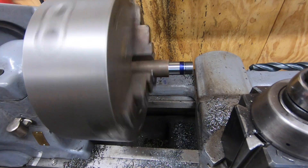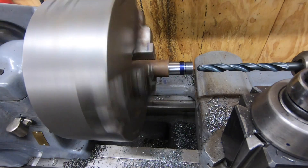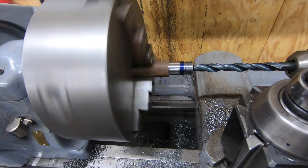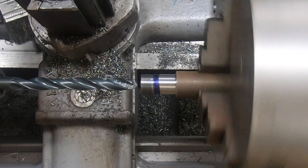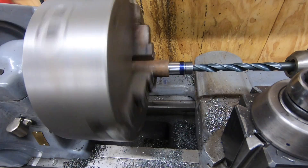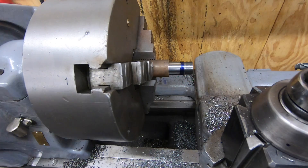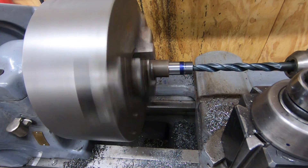I'm going to speed the lathe back up to normal operating speed. I have a 31/64th drill in the tailstock. I plan on using a half-inch chrome steel ball as the swivel joint, and I want to give that ball a more coned area at the top of the riser to rest in. I'm just touching the surface with the drill bit until I start to see a full round hole - I really only want to go in maybe 60 thousandths. After checking the steel ball, I think I want to go a little bit deeper.